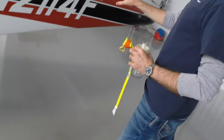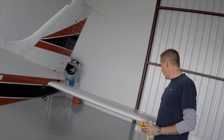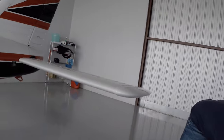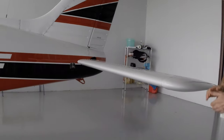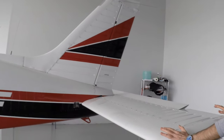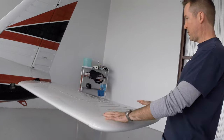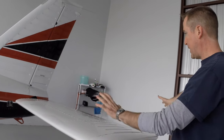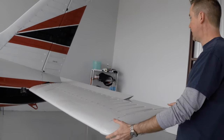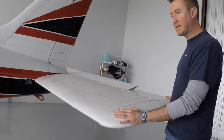All right, moving along the side of the airplane. Again, no dents, no wrinkles. Brings us back to the tail, the empennage, and Piper uses a stabilator instead of a stabilizer with a separate elevator. This is all one piece and the whole thing moves. So we just move it, make sure it moves smoothly and easily.